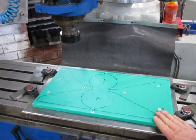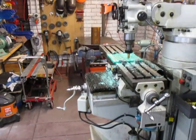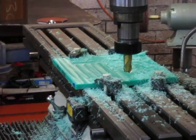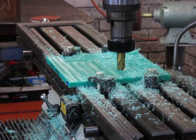To work out the best way of machining the thickness down, I did some trials with a few different cutters this morning on the other mill. What I came up with was a 25mm two-flute cutter — nice and sharp — which seems to do the job the best.